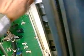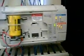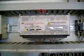So let me just get this knob loose so I can swing out the front PCB. There is a MicroLogix 1500 PLC that we had from other machines. You can see the big SRAM battery that I mounted on. Some relays that I used, and this is the light curtain controller that interacts with the PLC. So the PLC handles the light curtain and the pallet changing, and up the front. And this machine is running right now.